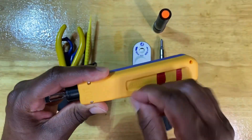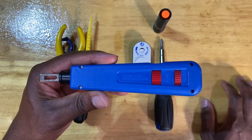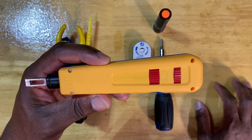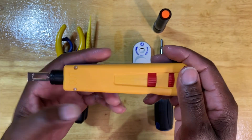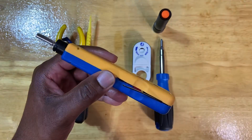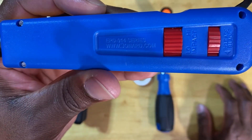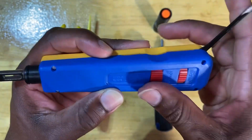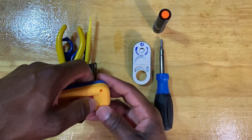Here is the punch down tool. I had a Jonard Tools punch down tool back when I was working with BellSouth — before it was AT&T — and my lead gave it to me. It ended up being my favorite tool. It looks similar to this. Part number EPD-914. It has a pick, which is very important — I always use the pick a lot in 66 and 110 blocks. It has high and low impact settings and your blade release.